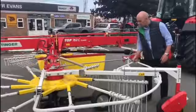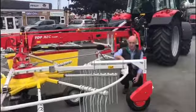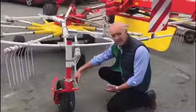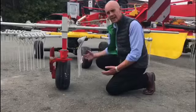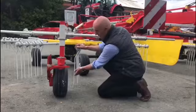The height of the rotor is adjusted via this mechanical handle here. I want to point out the angle of the tines when they are out of work — our tines tend to pitch forward with no load, so we get a nice lift on the grass when we go into work. With them pitched forward, the grass is sliding up the tines, lifting it off the ground.